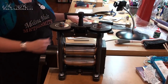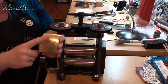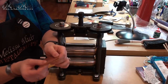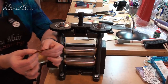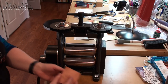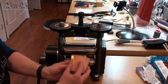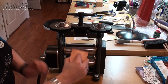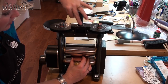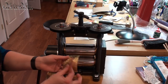Now I want to show you how I set this up when there's already a curve to the brass texture plate. I'm going to show this kind of backwards so you can see more easily. I take my pattern and set it so it goes along with the curve of my bottom roll, then hold the copper against it, and once again close down the mill to where there's a little bit of tightness — I can't pull it out, but I know I'm not compressing it.